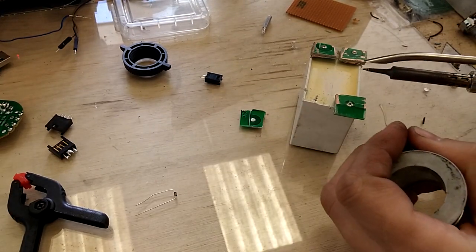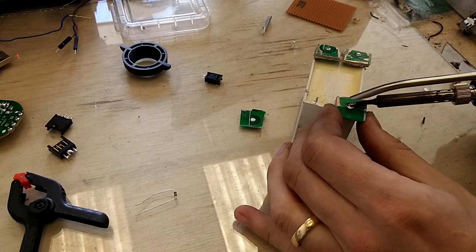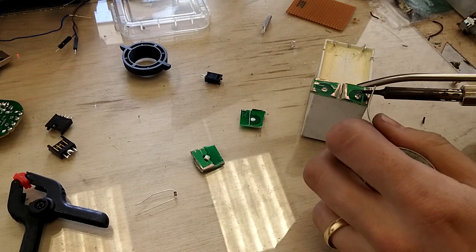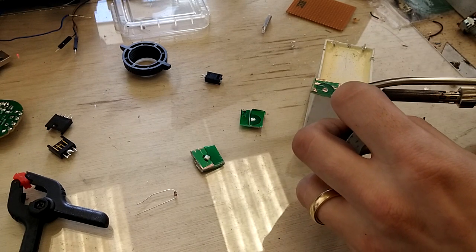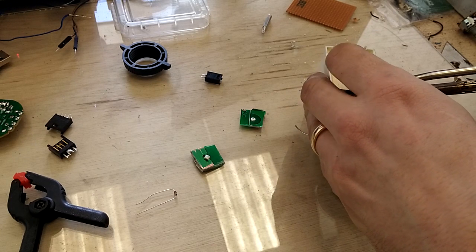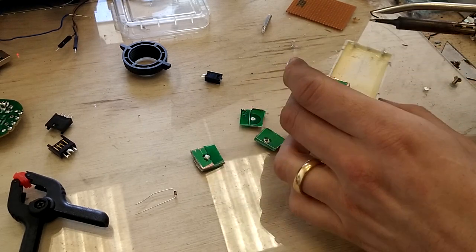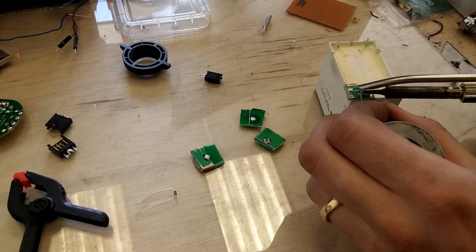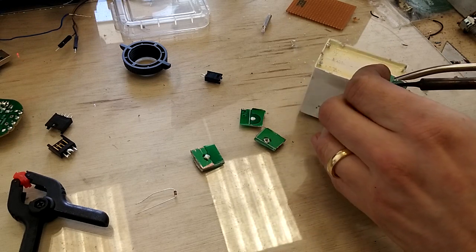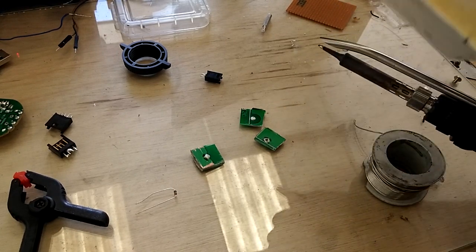See that? Look how easy that was to actually remove. I put a little bit of solder on there — this just wets it a bit, it's a bit of extra flux. And of course this allows it to melt all the way through, which allows me to just remove it. I'll do the next couple so you can see. Okay, that one's being a bit tricky. There we go — that one had a bit more copper on the board. A bit of solder just so the solder flows through, and there we go. We've desoldered all of the pins.